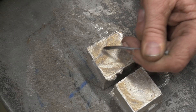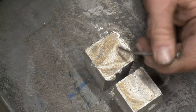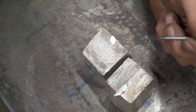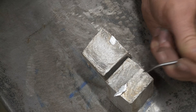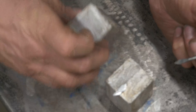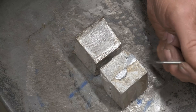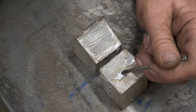I'm not seeing that with this guy here. Maybe a little bit right there, maybe around the edge. But on the bottom surface they look pretty close. Let's look at the gates coming in — this was the end gate on this guy, and this is the end gate on this one. This is the small sprue. Bubble there, bubble there, bubble there — maybe chalk that up to the parting line. Another hole right there, so that's on the input side. This one didn't have an output side because I vented out of the top. On the vent side here, we've got a bubble there, for sure.